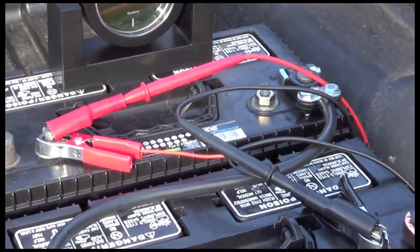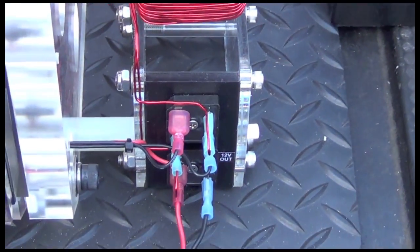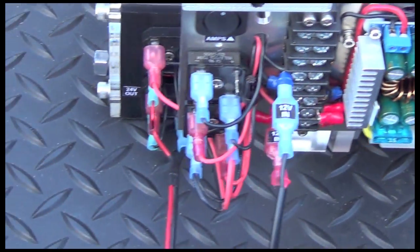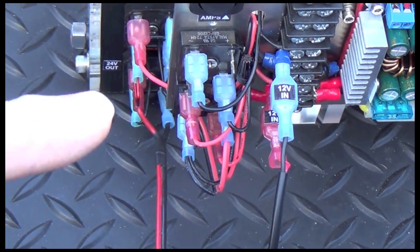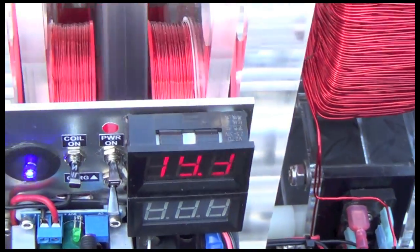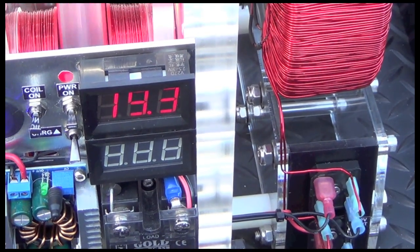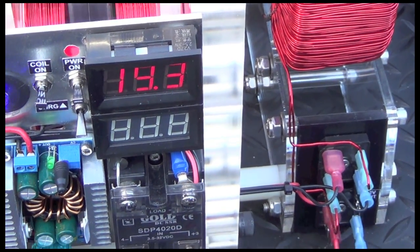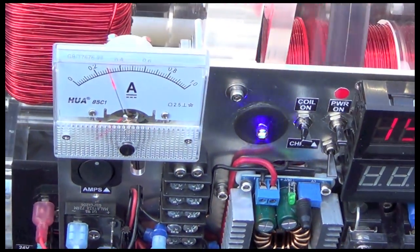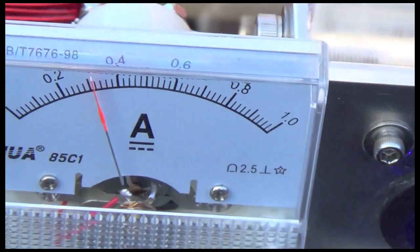You can see it's connected in series and I'm also going to connect the first battery with the 12 volt output down here, and on the other side, as I previously said, that's the 24 volt output. When operating with a 24 volt primary output, it's usually in resonance at about 19.3 to 19.5 volts — right now we're at 19.3.